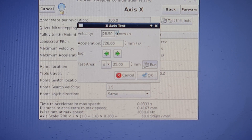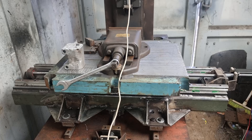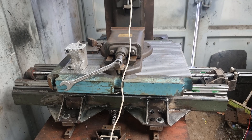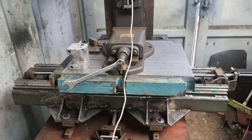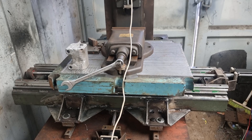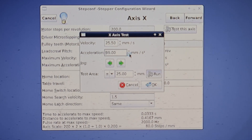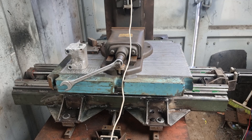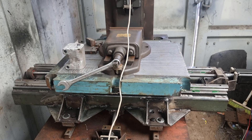If you click the run button, you can see the speed the machine is moving. As you turn the velocity up, you'll see it stalling out — meaning it's trying to push it too hard. By lowering the velocity, you change the speed and also set roughly the torque you can use. You can turn the acceleration up and it'll accelerate from point to point faster. If you turn it right down, you can see how slowly it accelerates.